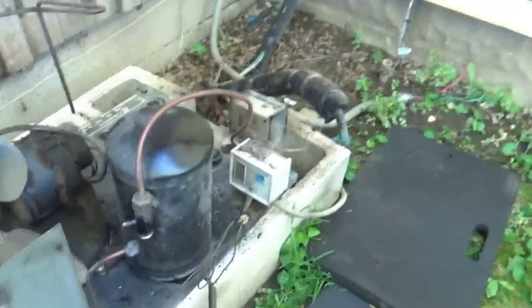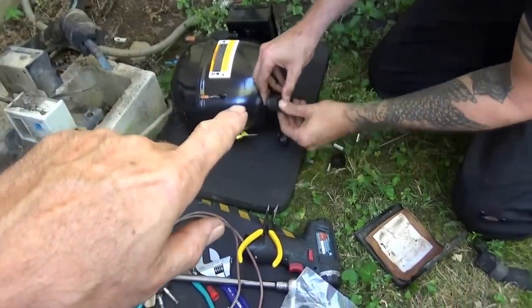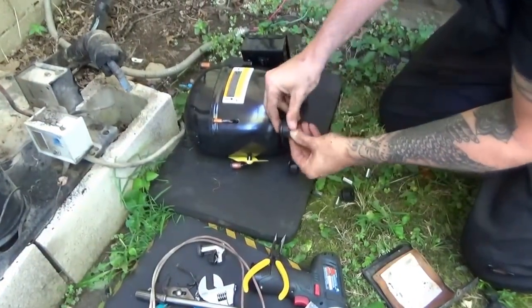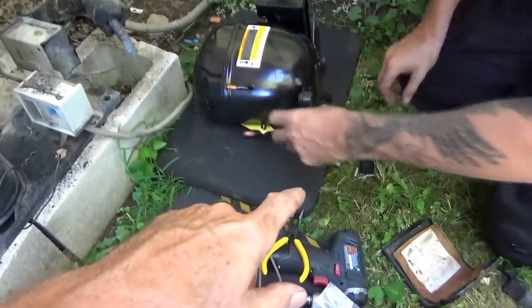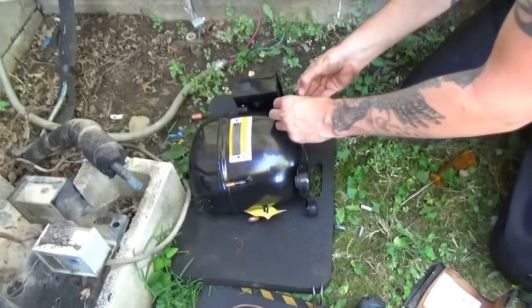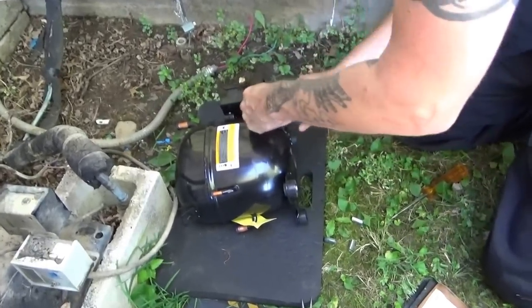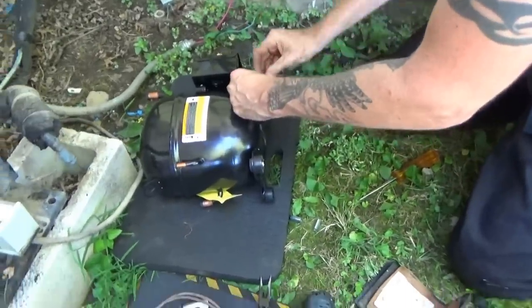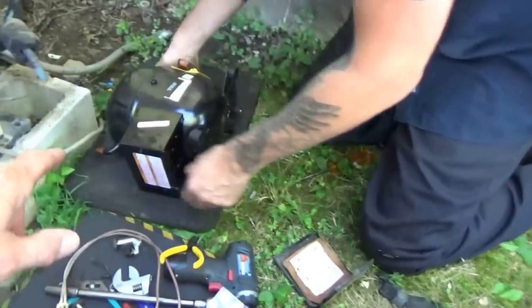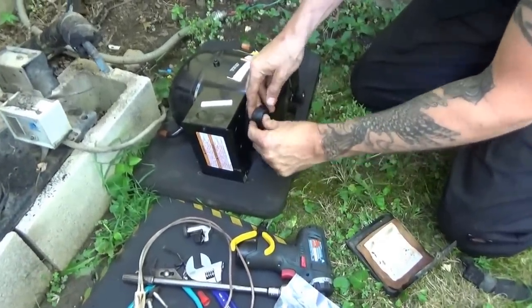Time for the new compressor. I'm putting the rubber feet on the compressor — that's important, otherwise the compressor will rattle. And there's little steel sleeves to put in them for the bolts. I just noticed you're kneeling on the ground while the compressor has the rubber kneeling pad in it, so the compressor's comfortable. Now, how are you gonna get the bolt on that one? Look at the electric box — we'll have to see. That might come off; might be screws inside.